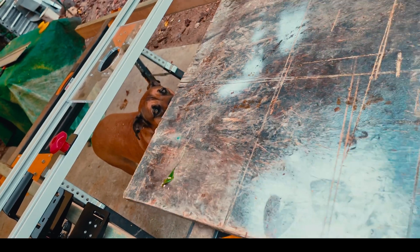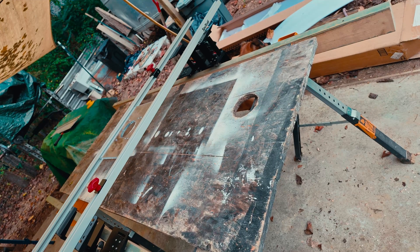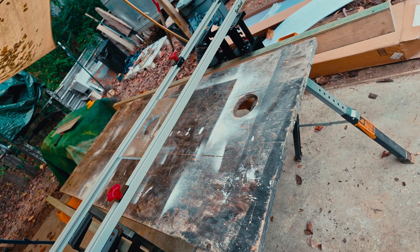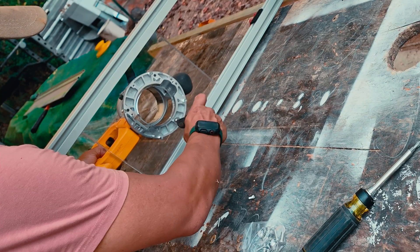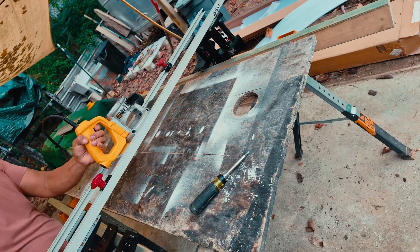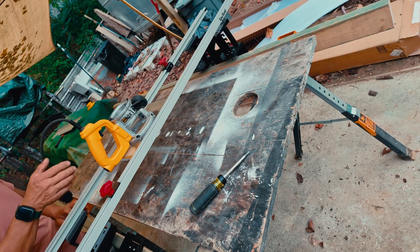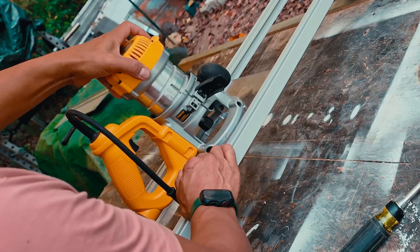Before I start flattening, I'll use a sturdier board for the table top. The sled will now roll along the 2x4s mounted to the sides of my sawhorses for added stability. Now I can attach my router base to the plate. This configuration should also help keep the paths of the wheels cleaner since any wood chips during the process should fall off the board before they can get to the wheels.